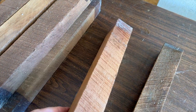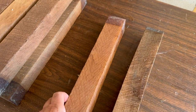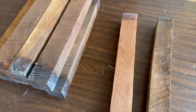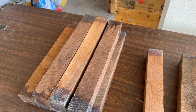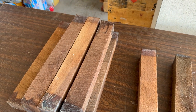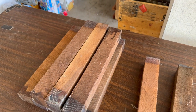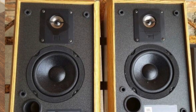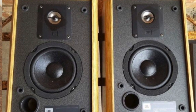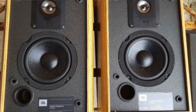The difference is these are a little bit longer than the typical ones I get — the typical ones are 12 and a half inches long, these are 16 — so I'm going to be able to make the speakers a little bit taller. I'm going to go with about a 15-inch speaker, which will make the front a little bit longer, and I may put the vent tube in the front. I'm going to play around with that design, and for reference I'm going to put up a picture of the standard JBL 2500.